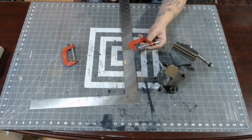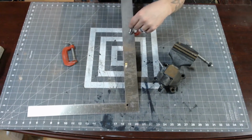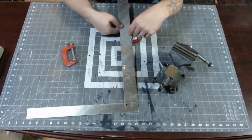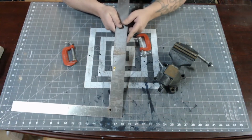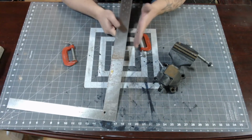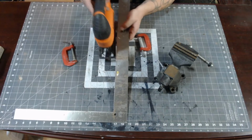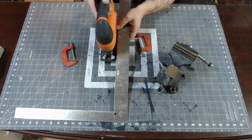I just put the straight edge on the thing, and then put the clamp on it, and then I can use the jigsaw or the razor knife, whatever, and just run straight down the edge. I don't have to worry about the things scooting around on me. Although, the jigsaw blades absolutely will cut steel or tin or aluminum, whatever this thing's made of. Do not run your jigsaw blade against this. Only run the edge of the jigsaw plate against this. If you were to put the blade against it, it's going to cut into it for sure. So only put the plate there.